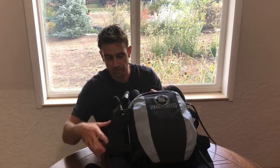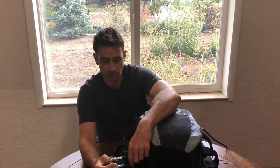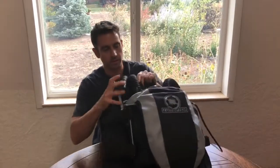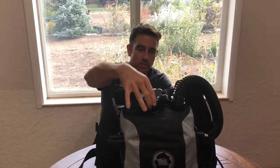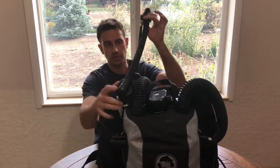I don't have them attached right now, but it's designed to take a two or three liter cylinder along each side right there. Your diluent cylinder would be over here on your left side. The regulators for diluent are down here at the bottom. You can see it's going to have one high pressure hose that goes to your pressure gauge, then an intermediate pressure hose that feeds your manual addition valve, and a third hose that comes up alongside the rebreather. At the top section here, this piece is fed from the diluent bottle — this is your ADV valve, and off that same line your low pressure inflator is also attached.